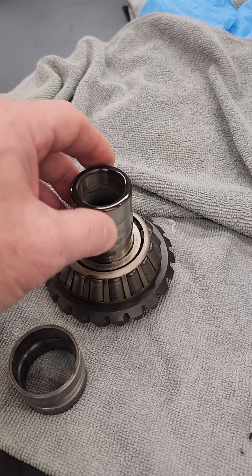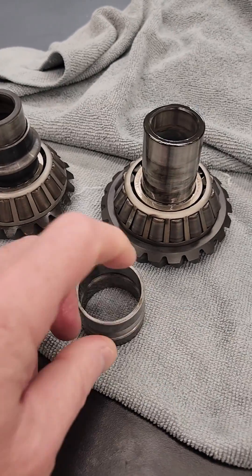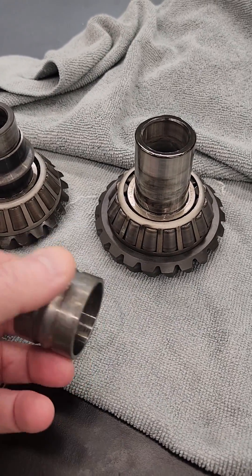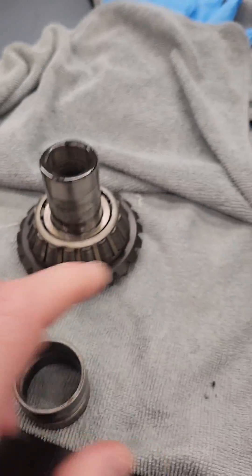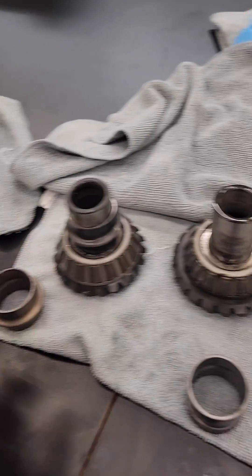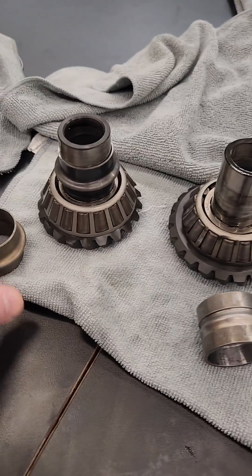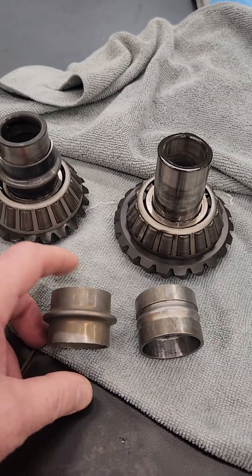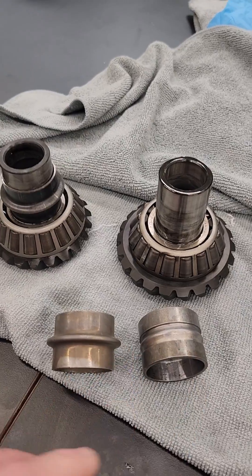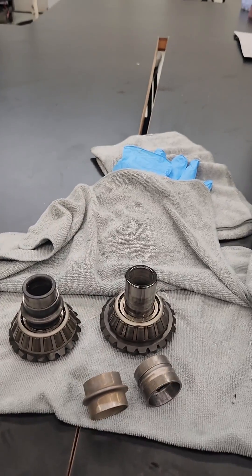The upper gear case top bearing feels pretty locked up, and the gear lube smelled really burnt. So we're going to go through this whole case, but I need a carrier right now. I'm going to take the carrier out of that drive and put it in this one, then get another carrier for this drive and rebuild it. That definitely is not a standard OEM part from Volvo Penta — so just to show you, if you run into that, it might be why you've taken the drive apart.